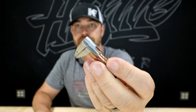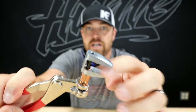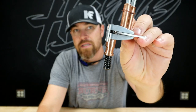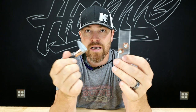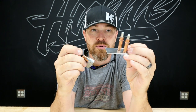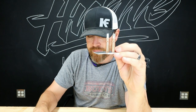They also make a kind that are like side clamps. Basically the same premise — it's got a spring in it, you use the same pliers, and as you squeeze it, these jaws spread apart. You can then clamp this onto something and it's going to hold those pieces together until you're ready to take it off. Really, if you do any kind of sheet metal work, these are a must-have. I also find they come in handy beyond just sheet metal — interior panels, working with ABS, any kind of flat surfaces you're trying to pre-fit that you'll end up screwing or riveting together. These are a tool you must have — the Cleco.